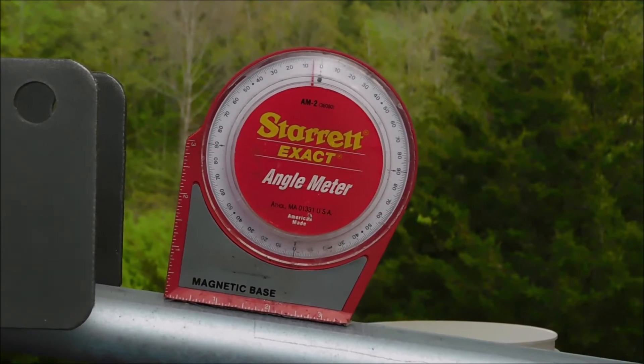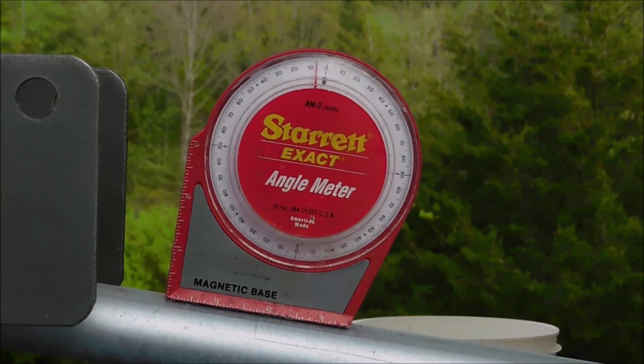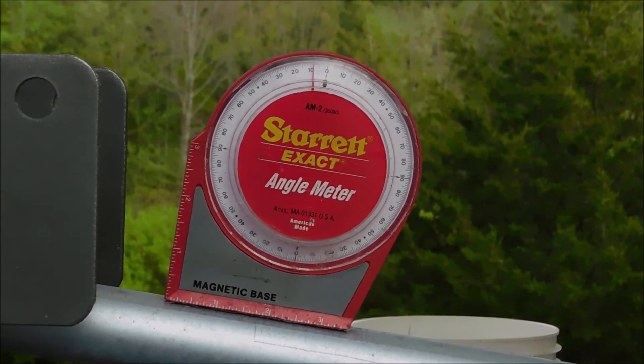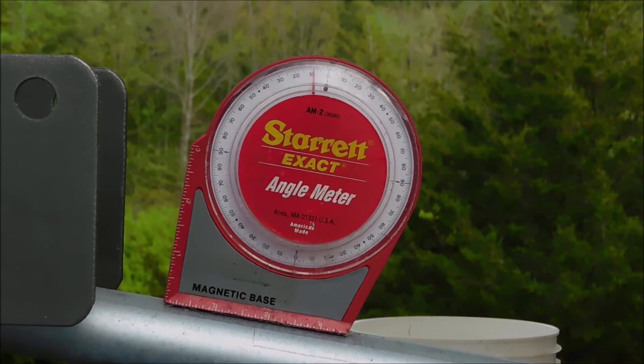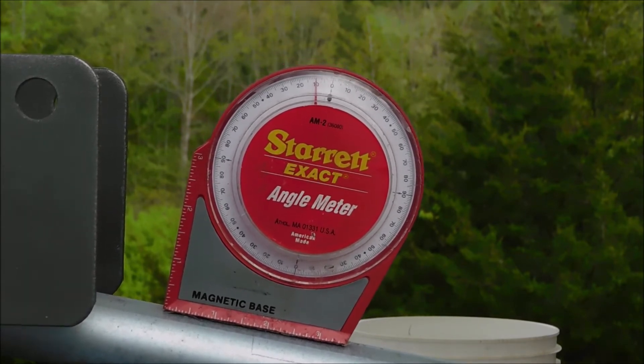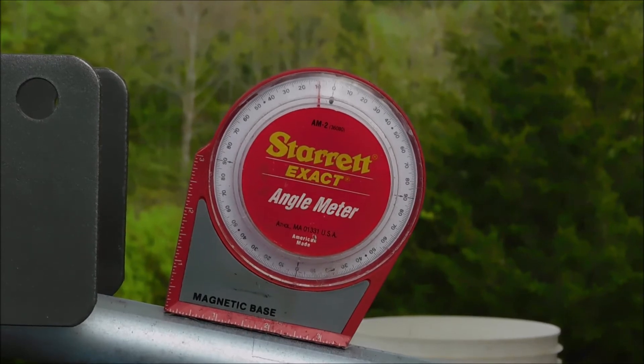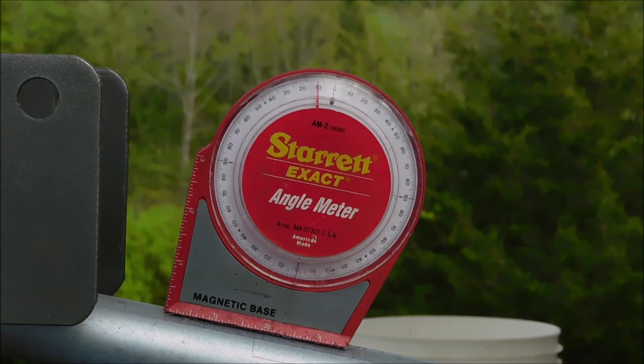Okay, we'll get this side to 10 degrees — roughly. It's working pretty good this way for me. Rather than trying to take the whole bend in one sweep, I can do it in three little sections, and it seems to keep it from kinking in the middle.